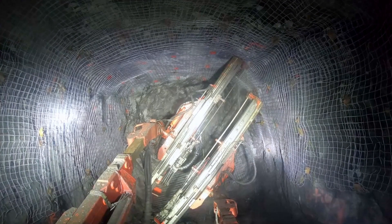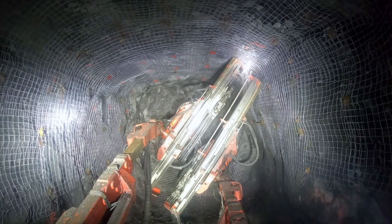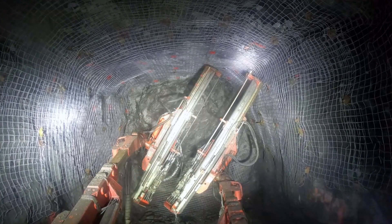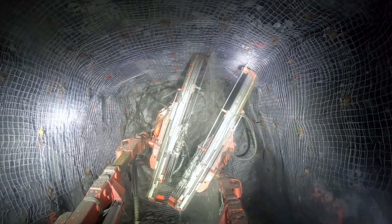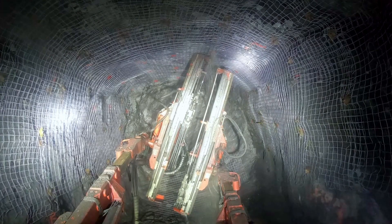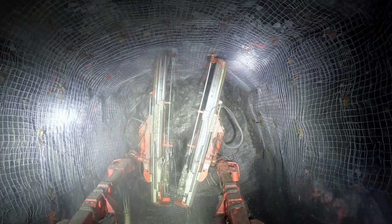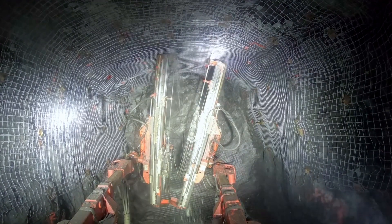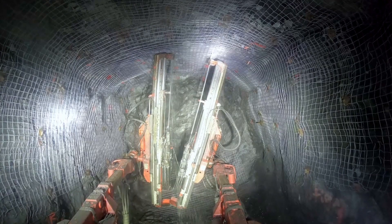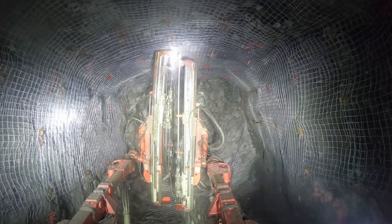I'm going to do a quick comparison of resin bolt installation with jumbos. This first method uses a plastic tube - it's a two-piece resin tied together, fast on the front, slow on the back. You pre-drill your holes, push the resin into the hole, and it has a plastic birdie on the end so it holds itself in. Typically we'll drill a ring or two all at once and install the resin, because it's so time-consuming to change over your tooling.